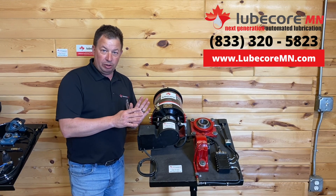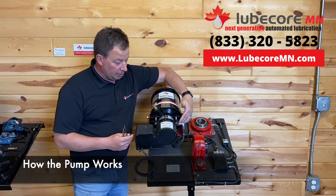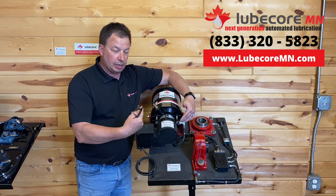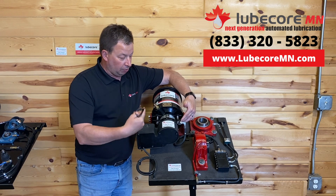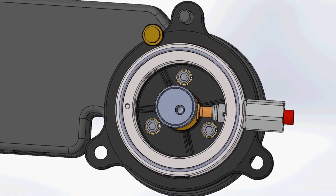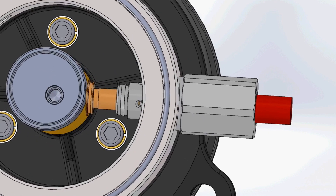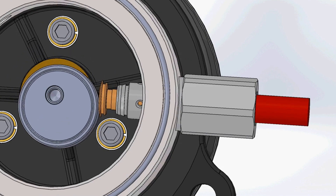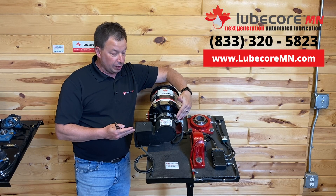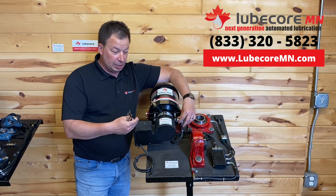The pump element itself resides on the side of the pump. When the pump kicks on, there's an eccentric cam that spins around and strikes a piston. Each time it strikes the piston, it's a known volume of grease that comes out of the pump. So when laying out the system design, how we control how much grease goes to each point is a function of two factors: how often do we run the pump, and what is its displacement — how many cc's per minute of run time are coming out.